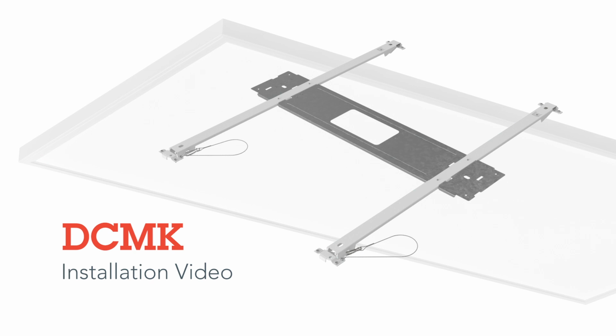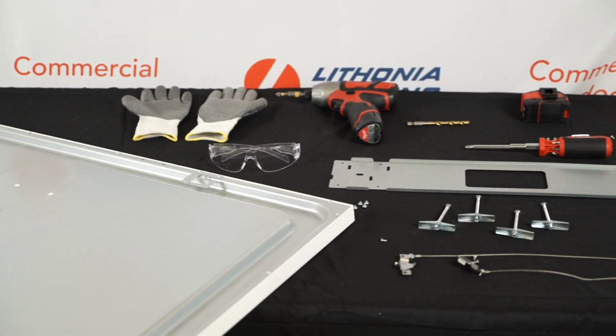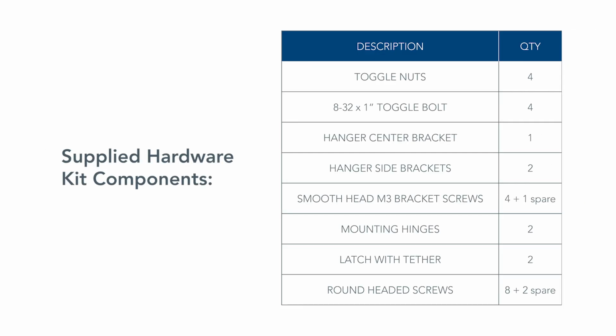Today we are going to review how to use the DCMK to mount the CPANL LED flat panel from Lithonia Lighting directly to the ceiling. Inside your CPANL DCM kit, you will find 4 toggle bolts and nuts, 1 hanger center bracket, 2 hanger side brackets, 5 smooth head bracket screws, 2 mounting hinges, 2 latches with tether, and 10 round-headed screws.